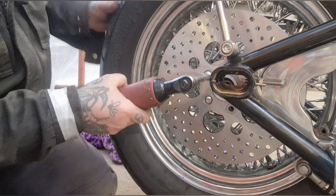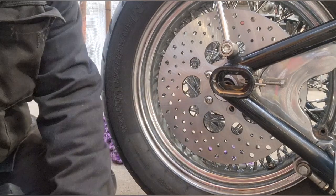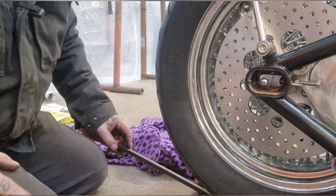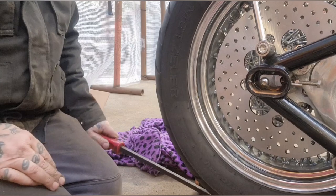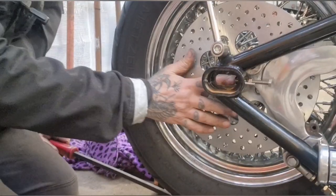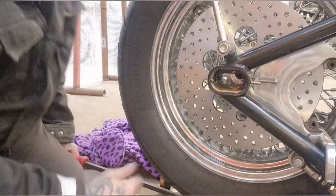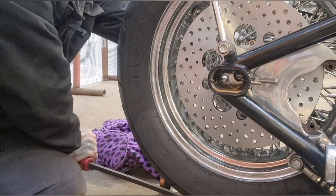Let's hope this fixes it - you know, everything lines up. I really hope that everything fucking lines up with regard to caliper etc. So I'll get those in and then we'll look at building it back up and see what's wrong. In the reverse of the disassembly procedure - that's the word. I've got a pry bar, I'm taking the weight of the wheel, and I've put that long drift through the spindle hole. We're going to try and wiggle and jiggle and get everything kinda lined up. There we go, I can push it around.